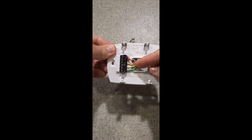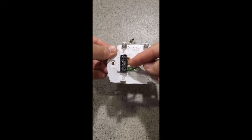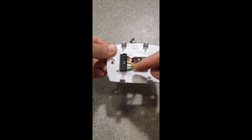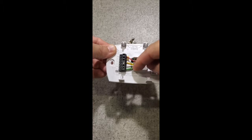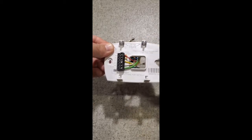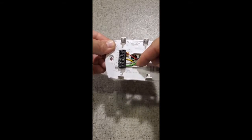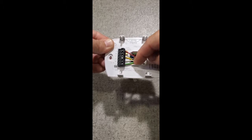The red wire goes up top to the RC. There's a little jumper — plug it in at the top where it says RC. Y is for yellow. W is the white wire. And G, although this is a green wire, this is a wire that I have running to the center pole on the toggle switch to give me power. So really, the only wires you're using from the existing unit are the red, the yellow, the white, and then this can be just a dummy wire that goes to the center connector on the toggle switch.